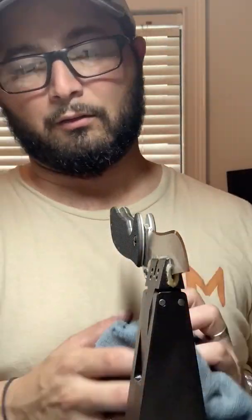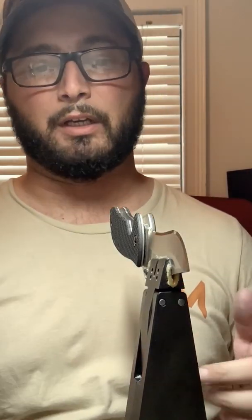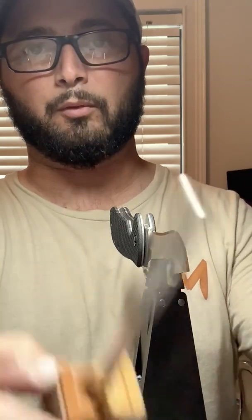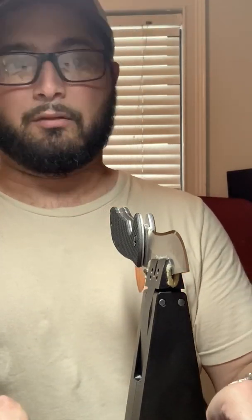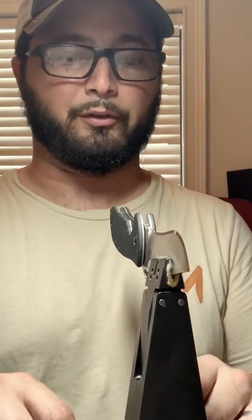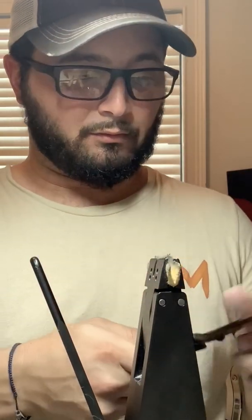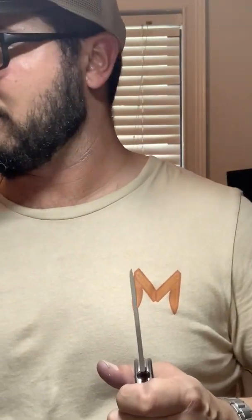So basically, roughly, counted out 100 on each side. 100 on the 2 micron, 100 on the 4 micron. That's basically 50 passes per side. That's usually more than enough. If you watch other Wicked Edge videos, they probably do far fewer passes. But I tend to exaggerate a little bit and make sure my work is nice and clean, or at least to my standard anyway.